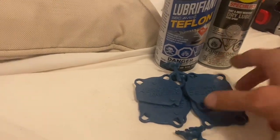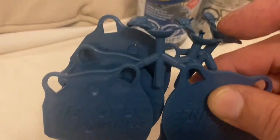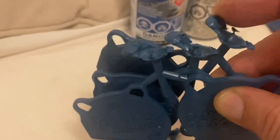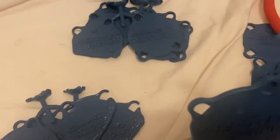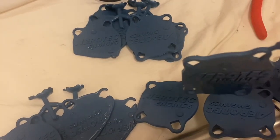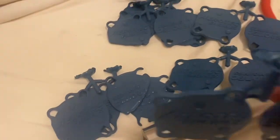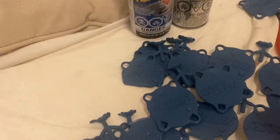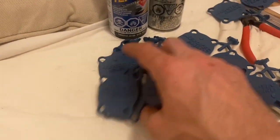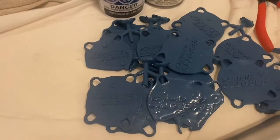When you first start shooting, you'll get a fair bit of plastic leakage around the cup where the nozzle comes in. A little bit of this is normal in the beginning — it gets less and less as you run it until there's almost nothing at all. This latest one is already much less than before. The nozzle gets a little coating, and the mold gets a little burnt plastic at the input, and all that helps it seal.